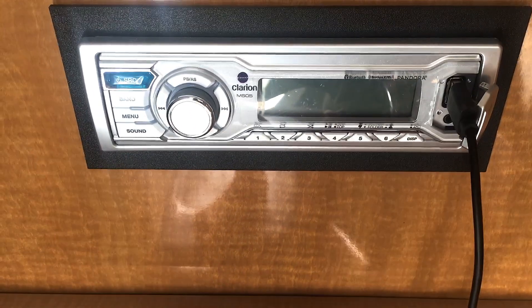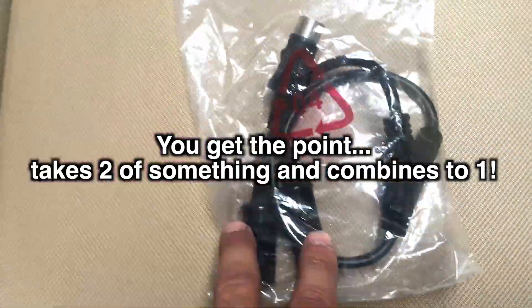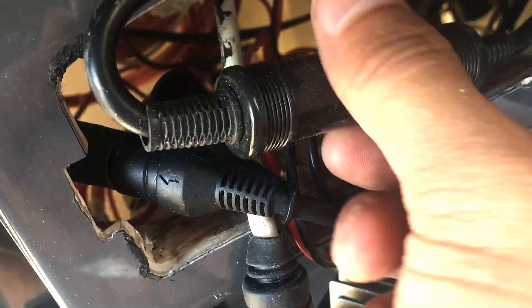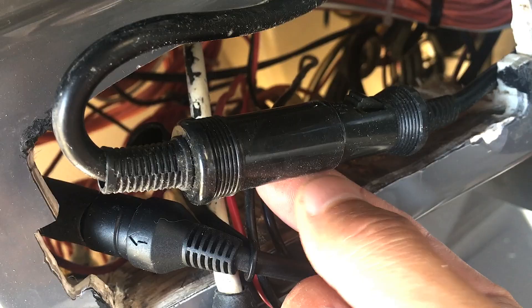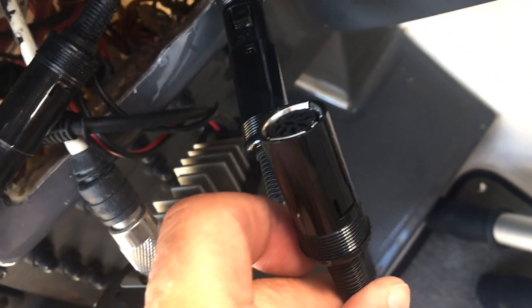The first thing we're going to need is the Y splitter — that's the MW-R-Y-C-R-E-T — and it's basically a two-females-to-one-male connector. The first thing is to find the connector. I've got this VHF back here that I basically pulled out, and I stuck my hand back here, and this is the DIN connector that we have to replace with the Y. So I'll do that right now. Here's the DIN that goes to the remote unit. This is the input coming from the back of the unit, and then this connector is where we're going to put the MW-6 right in there.